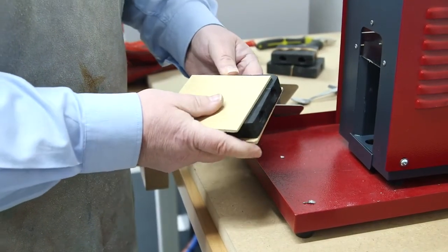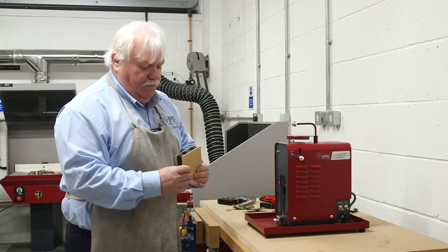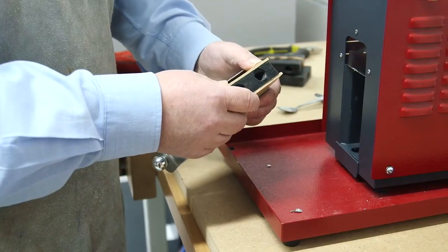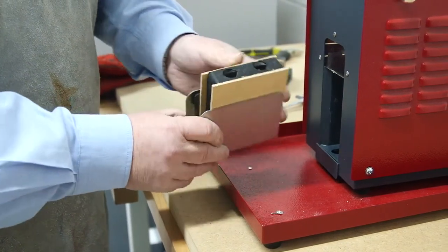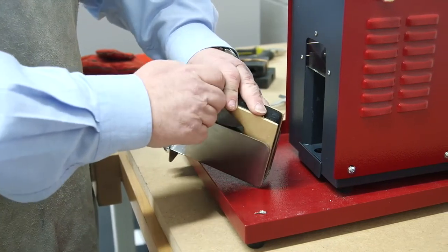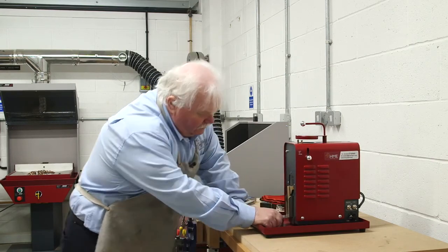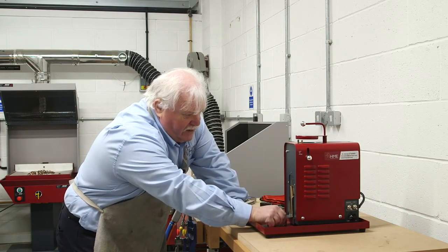So for this, to get the pressure equally across the whole mold, we've got two pieces of hardboard, and then we've got the casting holes where the molten metal is poured. These will go to the top, so they fit smoothly in there. You'll be supplied with some spring clips which you just place inside to make sure that there's equal pressure on the mold, so that it tightly fits together and pushed down. Then that just fits in like so, so that you'll see where the pouring point is, where you can get the holes then measured.